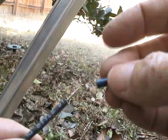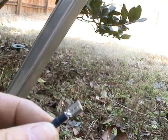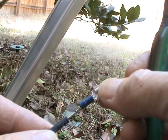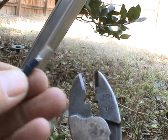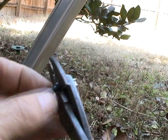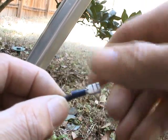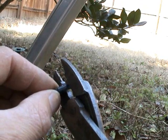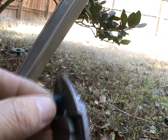So what I'm going to do is crimp a connector on both of these wires. Somebody out there asked me if I would show how to crimp connectors on wire — here it is, it's pretty simple. Just slide the connector over the wire that you've stripped, and then take your crimper. My crimper will do both insulated and non-insulated terminal connectors. I'll select the insulated portion and crimp it. Then I'll put the connector on the wire and use the crimper again — first the part for insulated connectors, and then the non-insulated one.